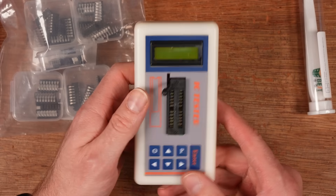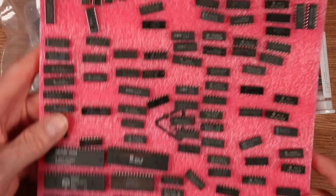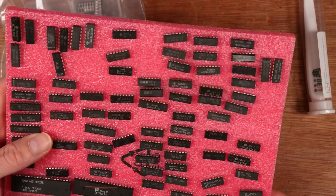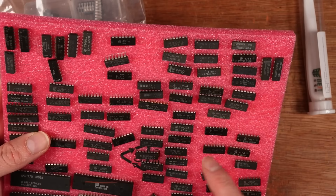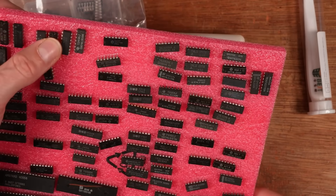The ones that I'm really interested in are logic chips. Here's a stash of logic chips that I've got. There are some Z80s down here as well, but most of these are logic chips and most of these are 74 LS series logic chips, which are important for retro computers because almost all of them were designed around the LS spec or the bipolar Schottky type of spec.